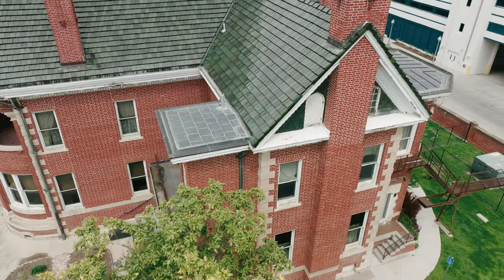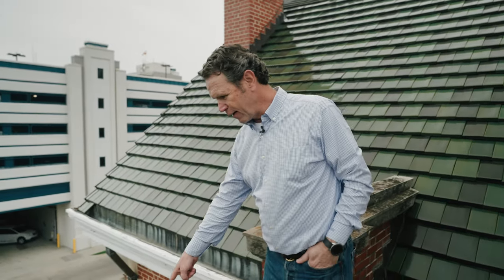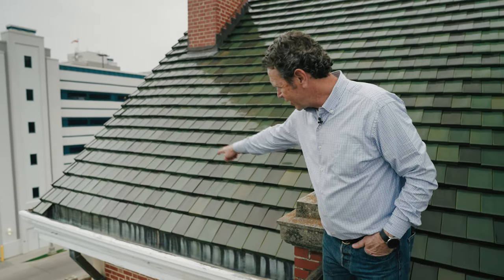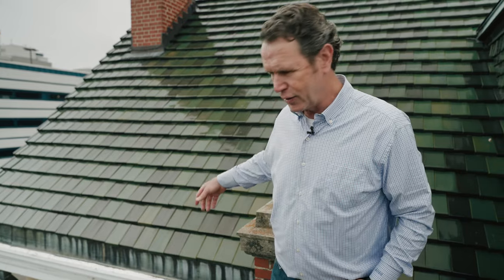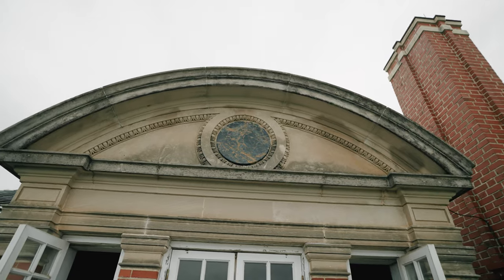On top of the world right now — I'm so excited to be doing this project. Look at this awesome Ludowici green tile roof. Unbelievably beautiful. Look at the green tile on the wall as well — we've got these wonderful details, this architectural capital. I was talking about the integrated gutters — look at this integrated flat gutter that goes underneath. But this is what's leaking. You can see that it's copper from the green patina — a hundred-year material, but it needs to be restored. This has just been neglected over time and needs a little TLC. When I see this beautiful pediment with the split fillet, the egg and dart, all in cut stone, all carved, and that beautiful granite medallion — it just makes me excited. We're restoring this jewel.